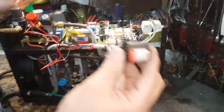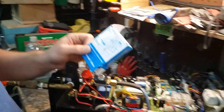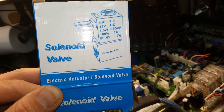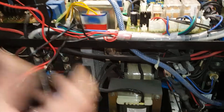Electrically, one of these little wires in here was damaged. So I went ahead and just purchased a new one on Amazon. I just did a search for '24 volt 1/8 inch air solenoid' and this is what came up. This one works good - I don't see a problem with that. I went ahead and did a quick wire to this just to test it.